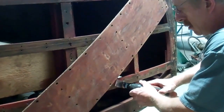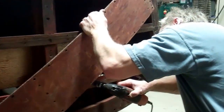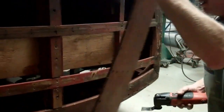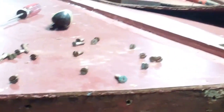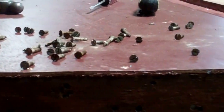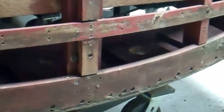Here's what we face trying to remove all the fasteners. Now we've got all three transom boards off, and what you will see right here is a bunch of screw heads that are nice and pretty — all green. Mind you, those boards came off the transom well above the waterline. That last one was the top board. So this transom has had water running through it extensively.